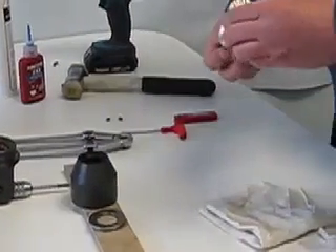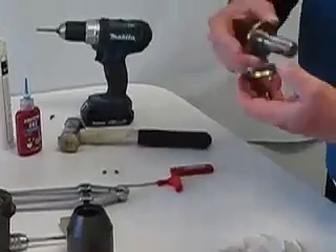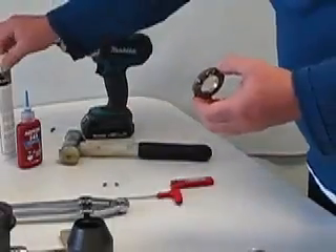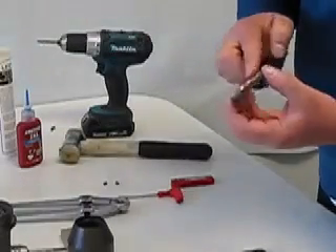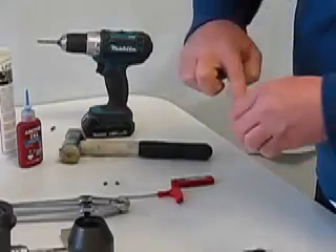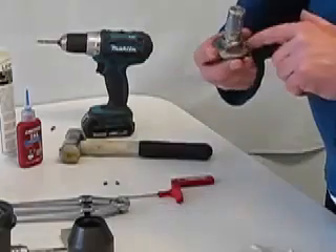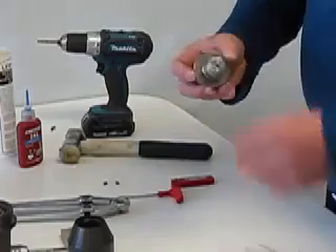The spindle — the bearing is in good condition in this case, but the grease has been removed with centripetal force, so we'll just reapply some grease, just wiping it through the rollers. We're looking at the thrust washer to ensure there's no overloading, and that's all in good condition.